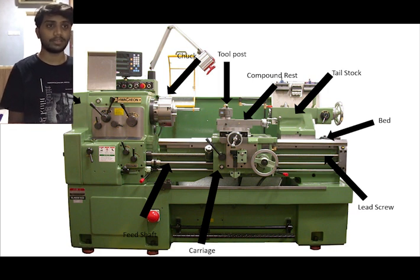Install a 60-degree threading tool bit and set the height to the lathe center point. Set the tool bit at a right angle to the work using a thread gauge. Using a layout solution, coat the area to be threaded. Move the threading tool up to the part using both the compound and the cross-feed, then set the micrometer to zero on both dials. Move the cross-feed to back the tool away from the work, move the carriage to the end of the part, and reset the cross-feed to zero. Using only the compound micrometer, feed in about 0.001 to 0.002 inch.